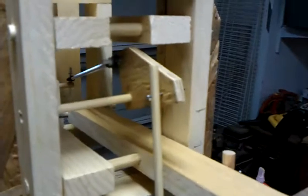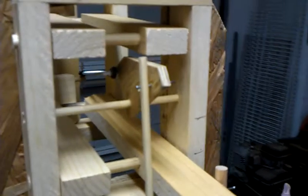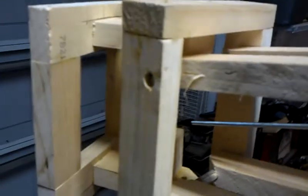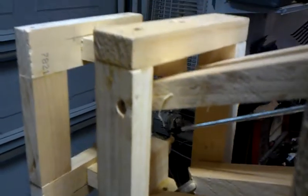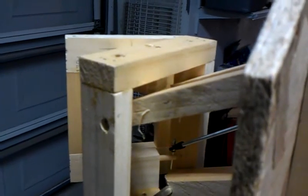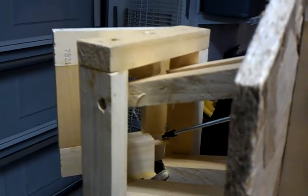You can see how the head motion goes up to a rocker arm, and that goes up to a control arm that's on the head. So doing it this way, regardless of how the neck goes up and down, the head will still go back and forth at the same rate.